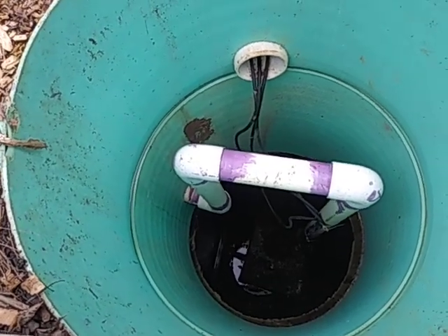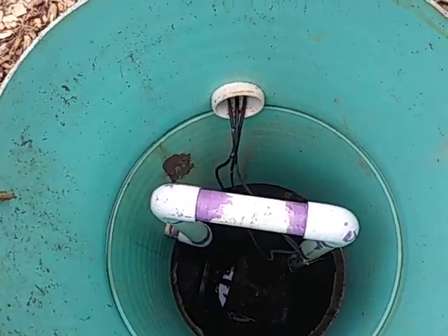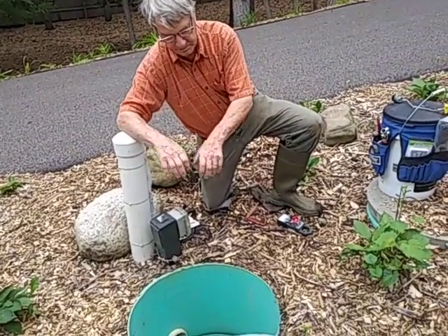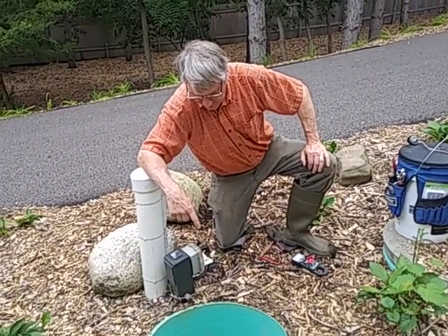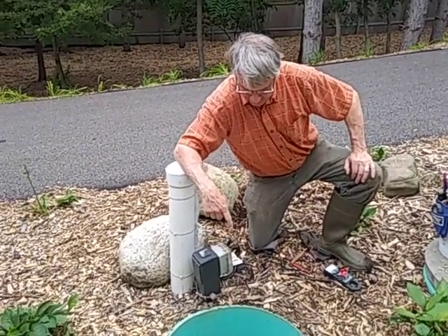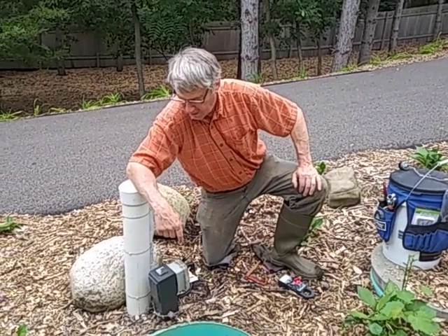The pump line comes up to replace the pump — we just saw the line right here. And then we'll put a Fernco, a threaded coupling there. So next time when the pump gets replaced, you just unthread it. I heard one of the other guys say not putting a threaded fitting or a disconnect coupling in there is the work of a hack.